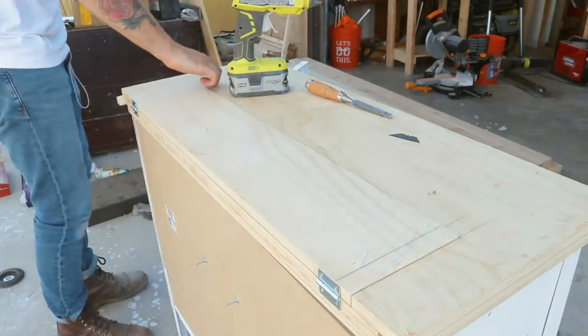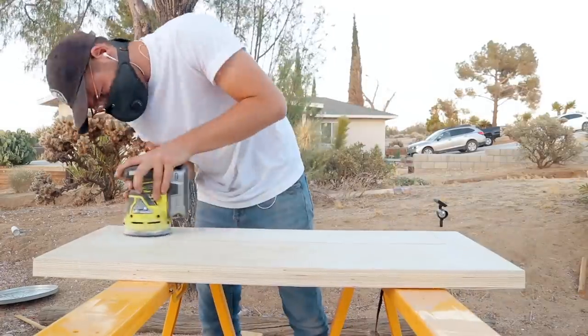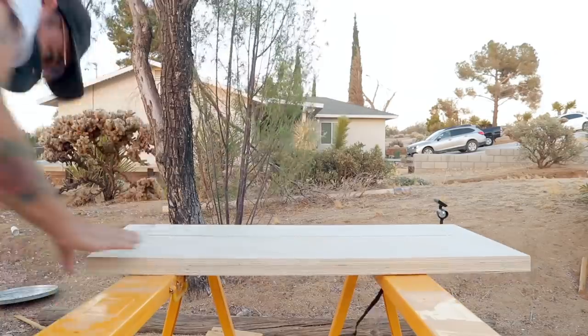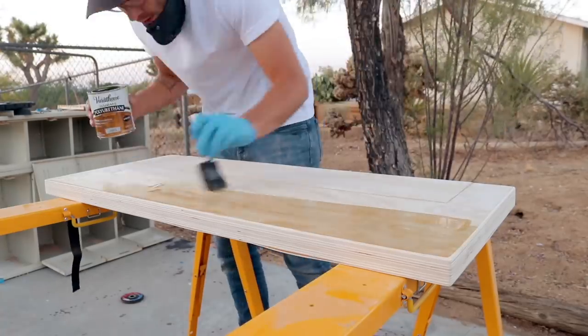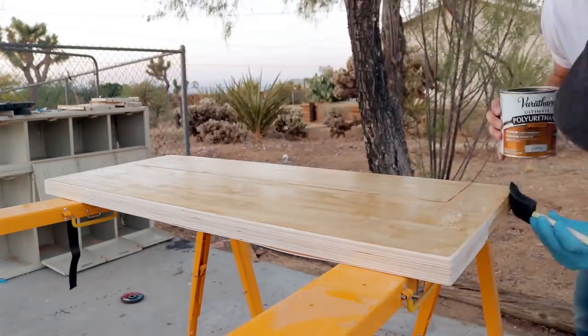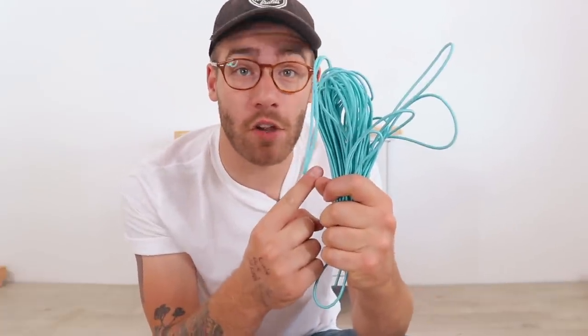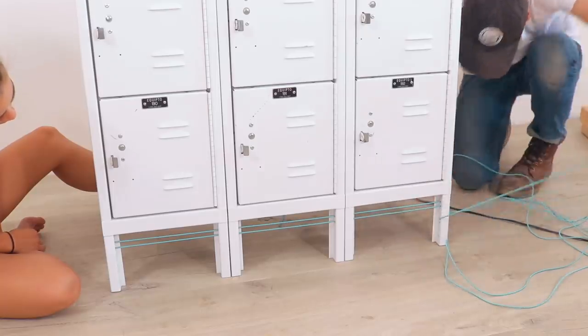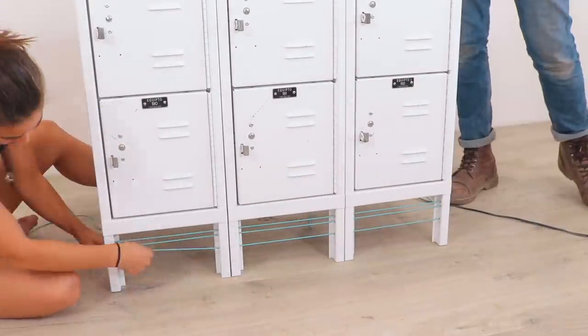I couldn't believe my luck — this worked on the first try. I removed the tabletop and applied three coats of Varathane oil-based polyurethane. Oil-based finishes are really great for visible plywood projects; it brings out a little bit more contrast in the grain. On my last stool video I used bungee cords as the footrest, and this week I went onto Amazon and found bulk bungee cord material. I'm going to drill out a few extra holes on the legs and wrap these around the base like an apron. This is the same color I painted the inside of the cubby, so this is going to help tie everything together. I'll leave links to this along with everything else in the description.